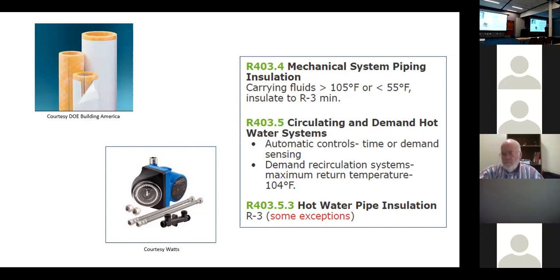Another problem: if you've seen a frozen air conditioner coil where it just keeps growing ice until you shut it off — these little air handlers have the air conditioning coil and hot water coil all built into the same slab. Four rows of A/C coil and two rows of hot water coil. Freeze the A/C coil and ice encapsulates the hot water coil with stagnant water in it.